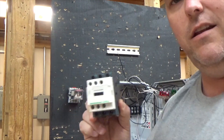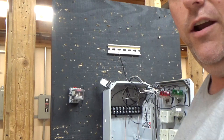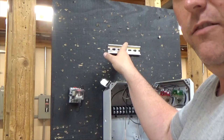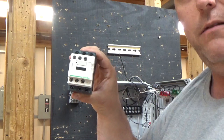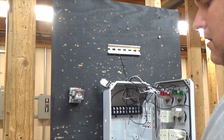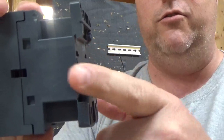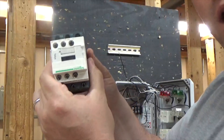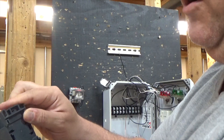What we're going to do is take this IEC. The nice thing with the IEC is we're going to use this bar here, which is called DIN rail. DIN rail is great because we can add anything — 8-pin and 11-pin relays, IEC control relays, motor starters, forward and reversing motor starters, which I'll be showing in another video. On the back here you can see there's a little groove. Basically all we're going to do is pull down on the DIN rail, slide it in, push it up, and the little spring in here will hold it in place.